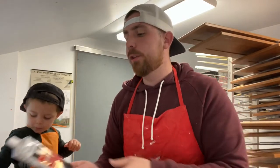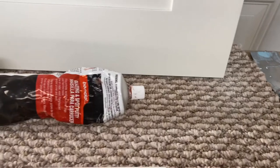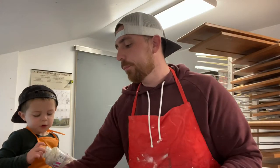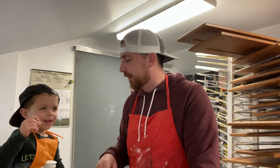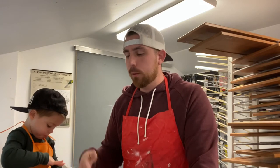We give them a quick sand and top coat to make all our little repairs and fix dings and dents. Once we've got our base coat of the filler sanded, we prime our door. We do a very thin coat of primer to start — just to promote adhesion. Then we come back, fill all our holes again, fix all our little dings and dents, give it another light sanding, and do our second coat of primer.